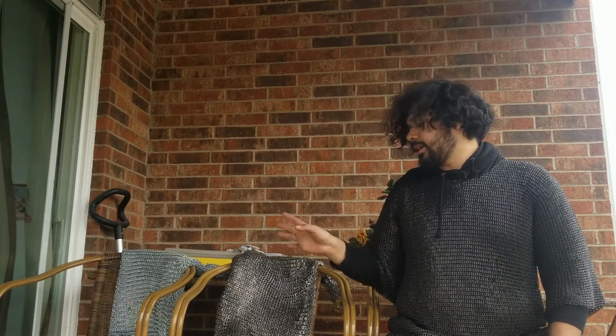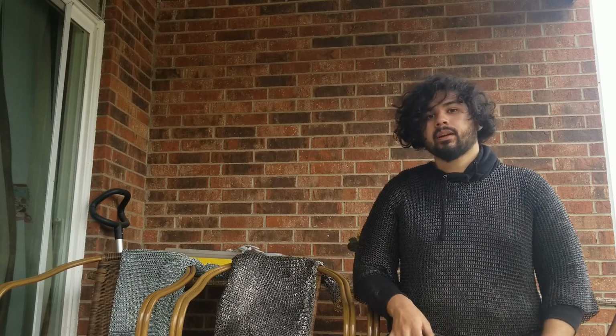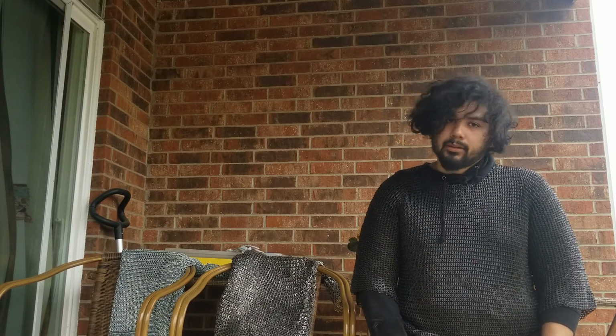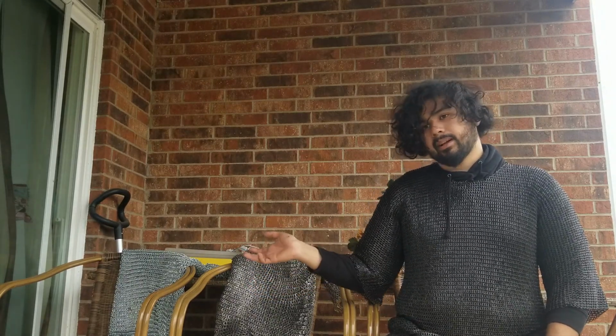It's a zinc-plated spool. The problem with that is it's an alloy intended to be very ductile and malleable and soft. It's easy to bend. It's very forgiving to bend back and forth over and over. That is the exact opposite of what you want for armor. So getting a false conclusion of what armor is like through that is not a fair assessment for chainmail.